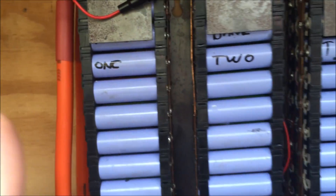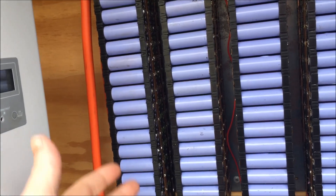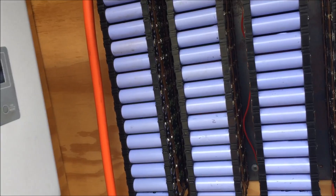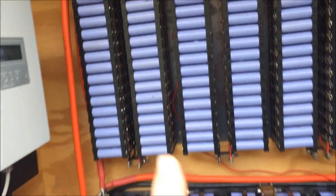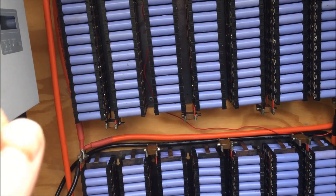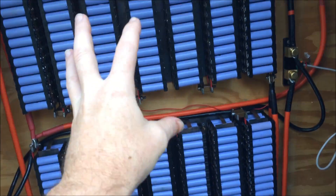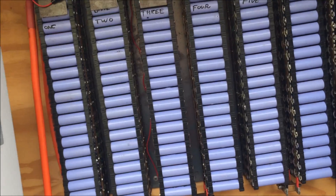On the positive side we have got the 0.25 millimeter winding wire from Jaycar, link below. On the negative side, that is basically just 240 volt cable out of the wall and I just stripped the copper out of it — the cheapest cable I could possibly buy from Masters down the road. I only needed one meter and one meter has done all these packs. The winding wire is about five dollars for a roll from Jaycar and I haven't used the entire roll across all the packs I've done — three cells, plus redoing one pack completely. You only need one spool of wire.